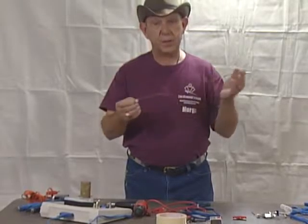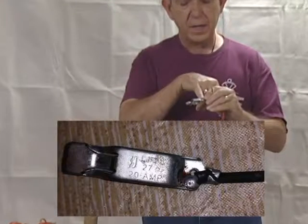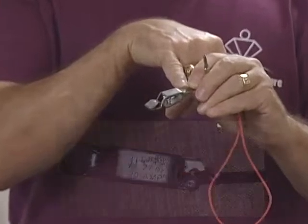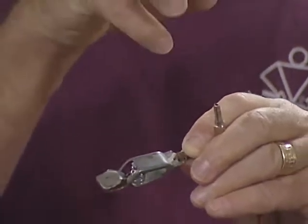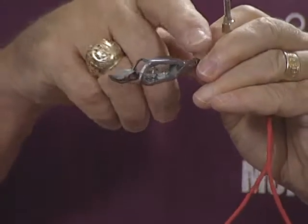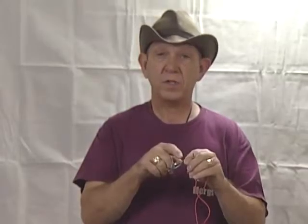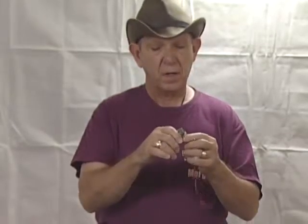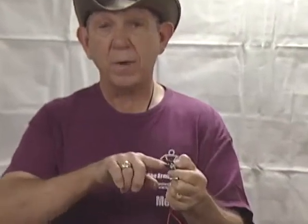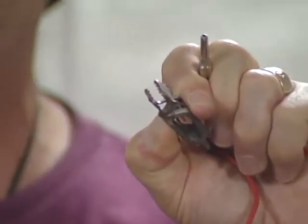Now inspect the clip on the A line. First, is the wire visibly soldered to the clip? Make sure the solder is not just a big blob sitting on top of the connector — you want it to be smooth, meaning the clip was brought up to proper temperature and the solder has flowed and made a good connection. Otherwise you have an intermittent connection that is not making good contact with the metal. Also inspect the clip for corrosion, especially on the inside where it makes contact with the lamé. This particular clip is very rusted on the inside and probably has problems connecting with the lamé.